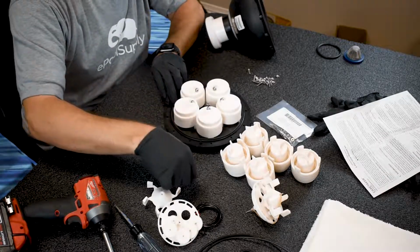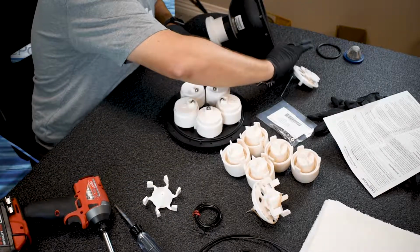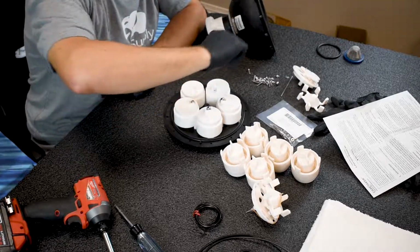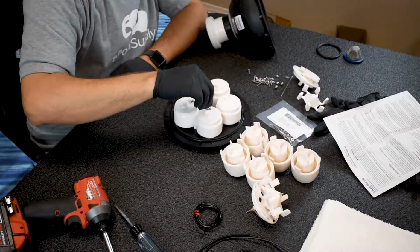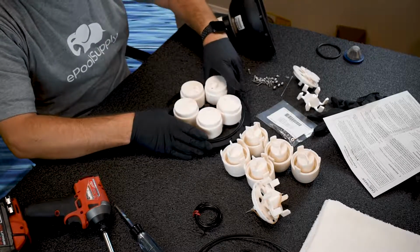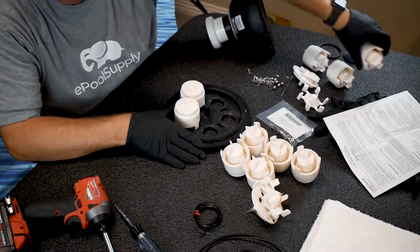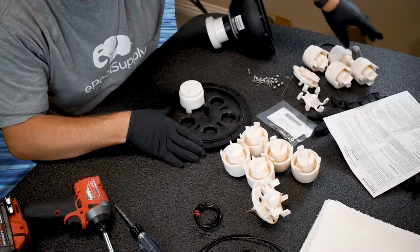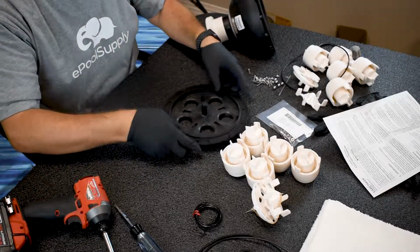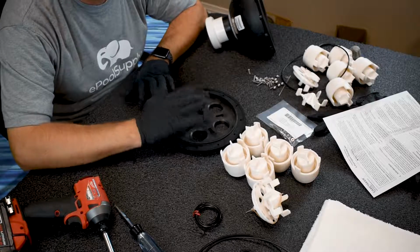Next, I'm gonna take this little shaft out. Two washers. Again, put everything that's used off to the side over here. My ball bearings. Those get kind of rusty sometimes over the years, especially if chemistry's a little off. You got low pH, it'll kind of rub the tarnish off and then they might rust out a little bit. And now these pistons come out, they just wiggle out. Very, very simple. And then I have an O-ring, big O-ring. And that is it, ladies and gentlemen, on how to actually get this thing completely dissected and taken apart.